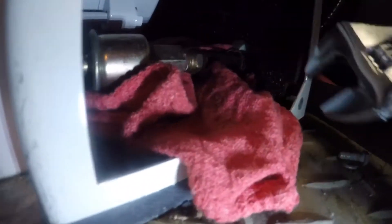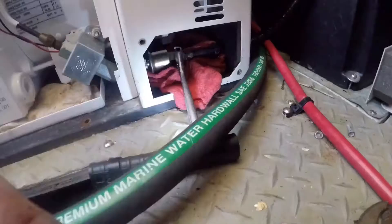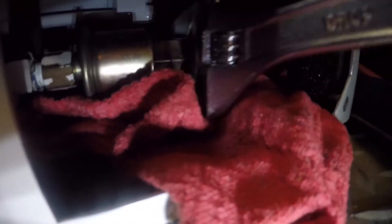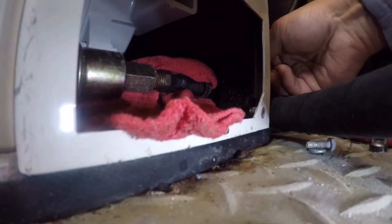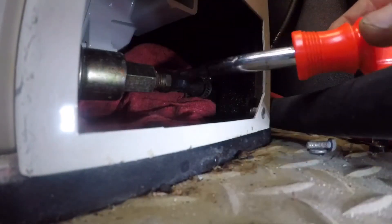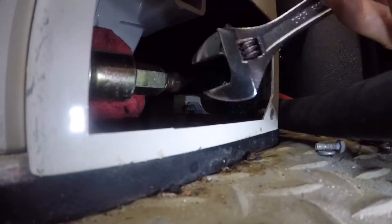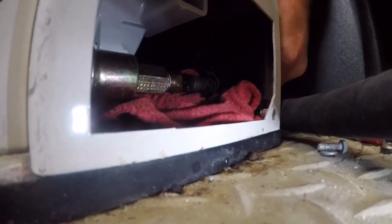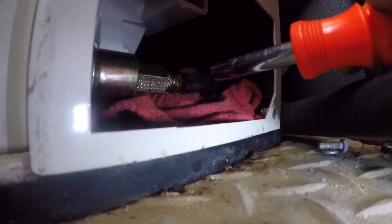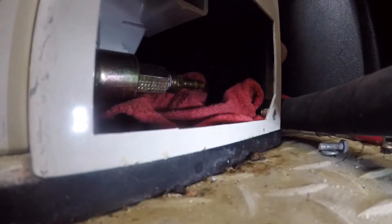Last on the list is replacing the fuel filter. The fuel filter is located underneath the lower right-hand side of the generator; it's got a small metal cover that comes off with a few screws. First you're going to want to loosen the gas line hose that has a hose clamp on it. It's a little difficult to pull off at first, so I started to unscrew the filter itself before I was able to twist the hose and get it off the barbed fitting at the end.